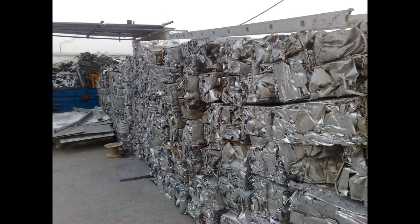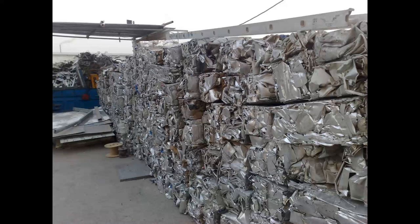While the process you have described is theoretically feasible, there are several important considerations to keep in mind. 1. Dissolving aluminum in acid peroxide solution. Aluminum can react with acid peroxide solutions, such as a mixture of hydrochloric acid and hydrogen peroxide, to form soluble aluminum salts. It is crucial to ensure that the solution is free from impurities that could affect the subsequent precipitation and purity of the aluminum.